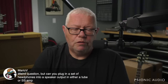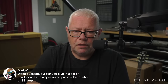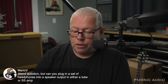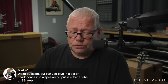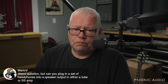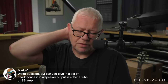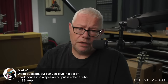Mario V. asks a weird question: can you plug a set of headphones into a speaker output in either a tube or solid state amp? In a tube amp, if you do that, you'll blow your output transformer shortly after you smoke your headphones. Solid state amp, you'll just smoke the headphones. No, that's a much different level. It might be fun to do with a solid state amp sometime, just to watch the little earbuds literally go up in smoke. Do not do that.